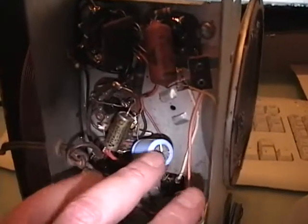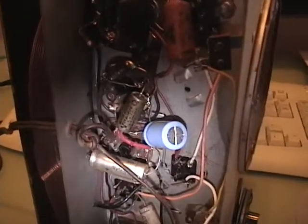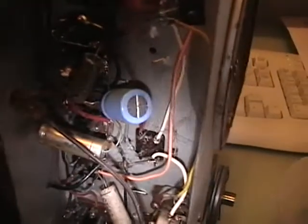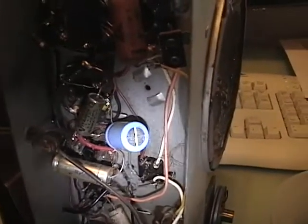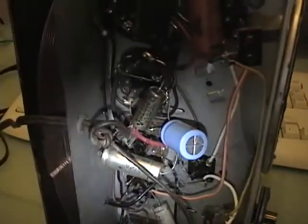So here we go — there are the old capacitors. I know it's tempting when you get something like this to just plug it in and turn it on, but what's most likely to happen is those capacitors would literally explode on you, which could take out the rectifier tube and maybe some of the other tubes. At the very least use a dim bulb tester, but even beyond that, in a radio this simple I wouldn't bother because you're going to be replacing the capacitors anyway. Open it up, inspect it cosmetically — somebody might have started to repair it and given up, with wires shorted out inside, or parts may have already exploded. Just take your time and be patient with it.